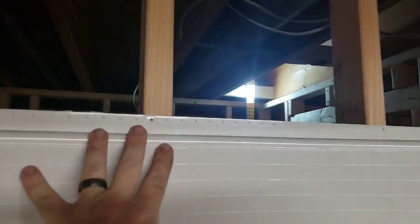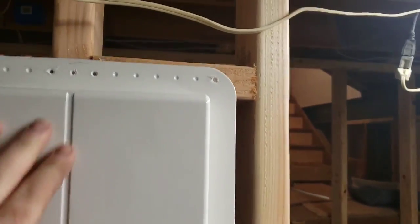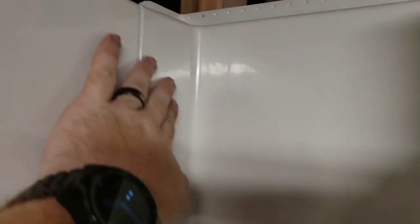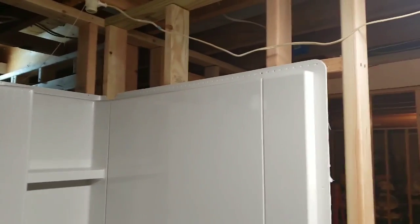What I ended up doing is pre-drilling holes at each stud and using the impact hammer to get them into the wood and through everything to secure it. Some of these do crack a little bit, so be careful - when I was screwing this in it actually cracked slightly on the edge, but it's high enough that I'm not concerned. My one stud here has this screw into it. As my drywall guy comes in, he'll actually drywall that lip all the way across the top. This wall I extended out a little bit with some cross braces since I don't have a beam going straight up and down.